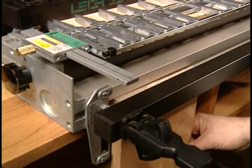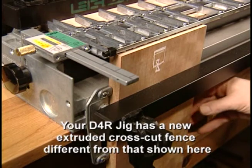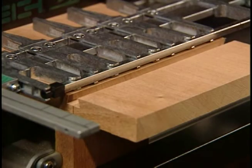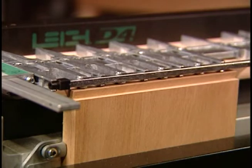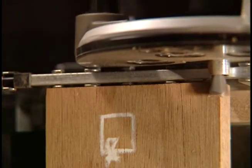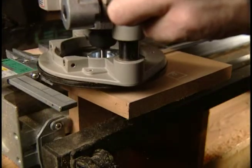With the finger assembly in the half-blind tails mode, the cross-cut fence fits into the recesses in the ends of the tail guides to allow routing of sliding dovetails. Using the cross-cut fence as a guide surface for the guide bush, you can make lateral router cuts across the faces of horizontal boards to route sliding dovetail slots, and across the top end of vertical boards to cut the tails. You can use virtually any guide bush dovetail cutter combination for sliding dovetails.